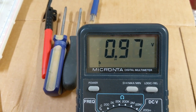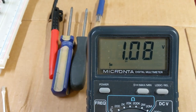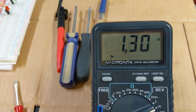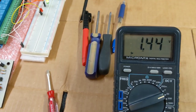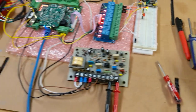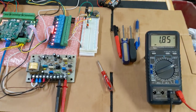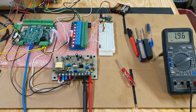And then what I did is I recorded all these values. I recorded the values on the motor controller on the Precision Matthews machine, and then I recorded the values coming out of the Acorn through the KBSI 240D board. And I can tell you this, the output coming out of the Acorn is a very linear output. And that's exactly what you would expect. That's what it's supposed to do.